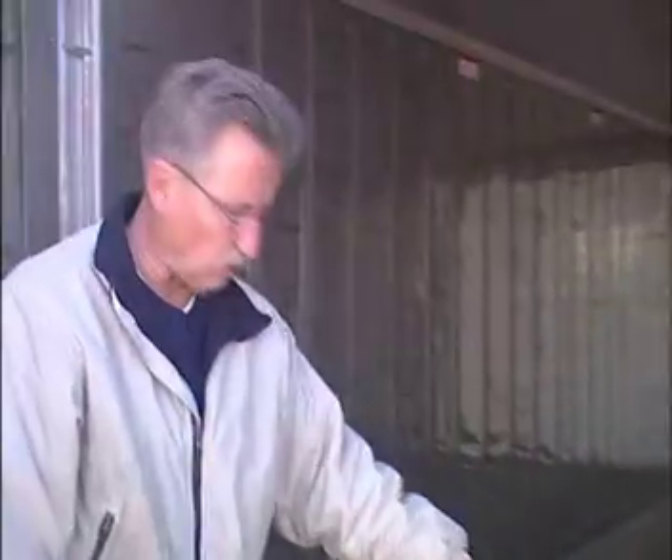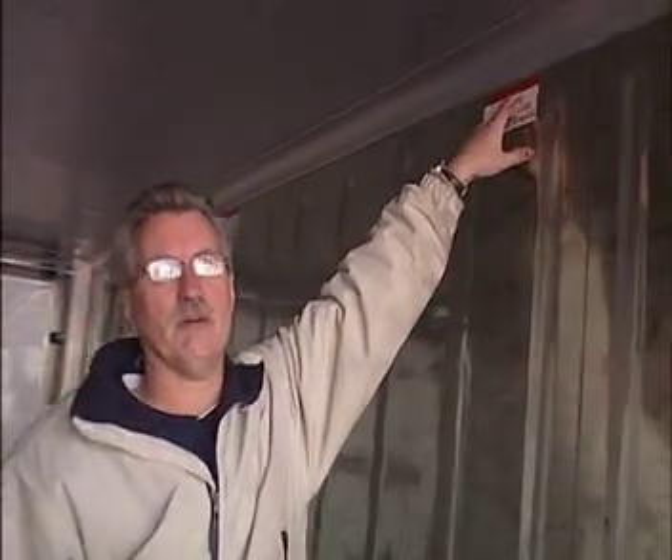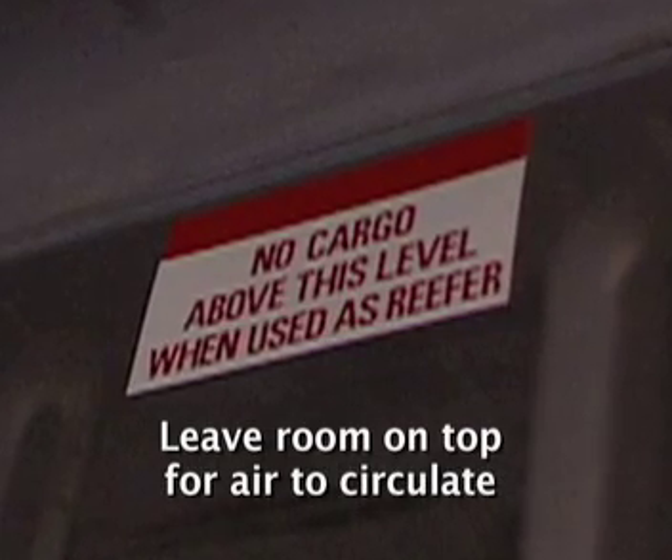You can see there are multiple gaskets. Now inside the container, the first thing you'll notice is this is not just a flat floor — it's actually elevated to facilitate airflow. Cold air comes down through the floor and circulates through the container. There are also marks identifying that cargo shouldn't be loaded above a certain line, which facilitates air flowing back to the cooling unit. Do not load your product all the way to the ceiling — leave room for the air to circulate.